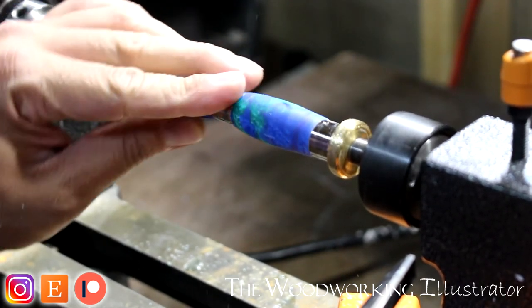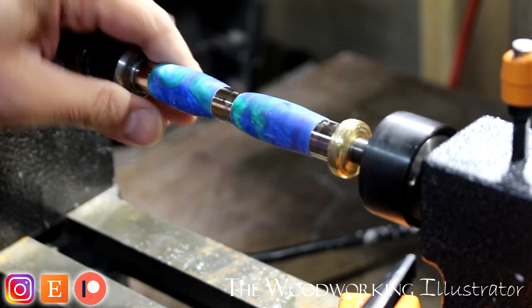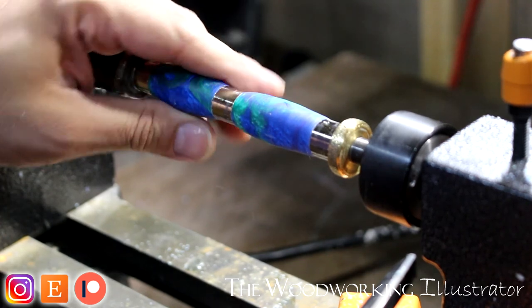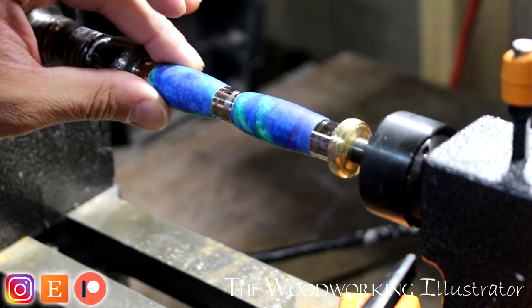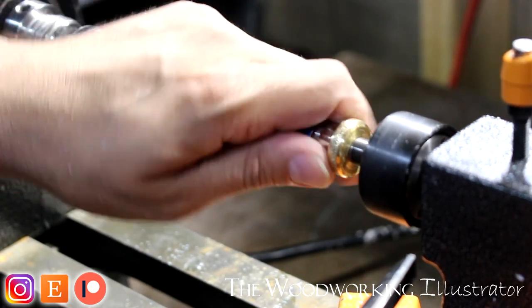With acrylester and even with acrylic, I like to start off at 100 grit. I mean, different people have different preferences, but I like 100 grit because it really makes sure to get off any little flaws or anything in the plastic.